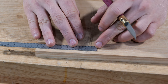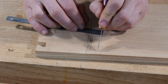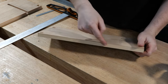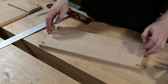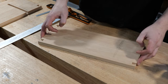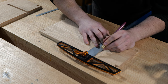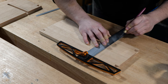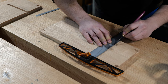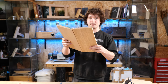To confirm: from the bottom we have 102.5 taking us to that line, and going back 10 millimeters to 92.5 is where our first line is. There are our boundaries. Next we need to square those lines across the width of the cabinet, remembering we have a face side and face edge. The face edge is the front of the cabinet - that's what we squared the ends off of - so even if the back edge is slightly tapered, the shelf will still be parallel because we're referencing off the front. That is really important especially if you've prepared these boards by hand. We put the knife into the mark, slide the ruler up to it, and drag back the knife line, then do the same for the second line. We double-check against the already-cut panel and it's bang on.